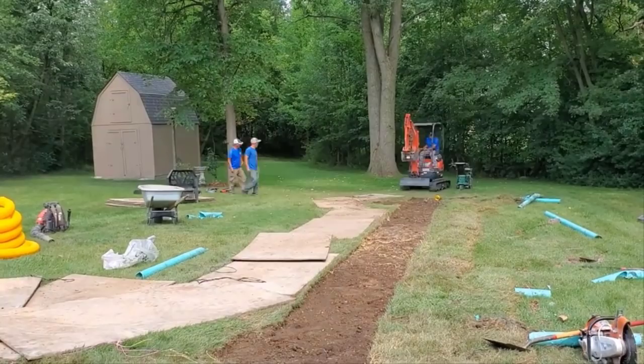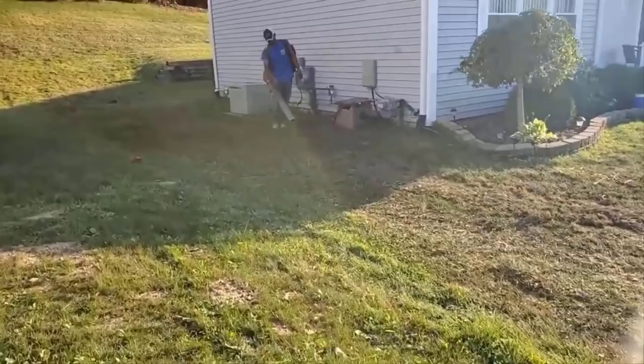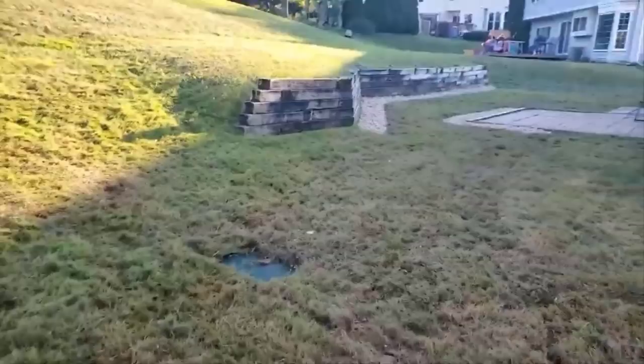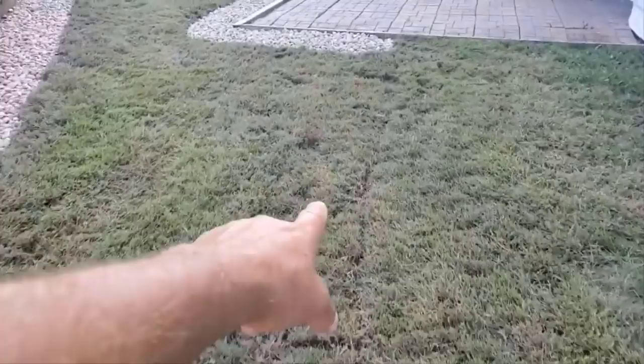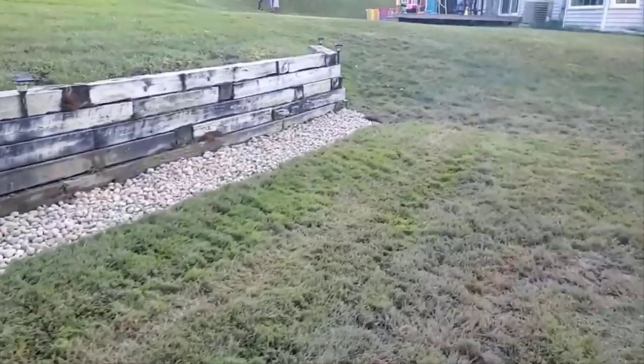Let's head back to Bloomfield Hills, Michigan. All right, we're at Bloomfield Hills, Michigan, and I wanted to show you the system with the grass on top. Right here's where the manifold was. The French drain to leach field literally came together. There's our 24 by 24 blind inlet. You can see how perfect we put these pieces of grass. It's like a puzzle. And then you see the open French drain. To our new subscribers, an open French drain is when you don't have any grass growing over top of it. The water runs right through the stone, just uninterrupted. Nothing moves water faster than an open French drain.